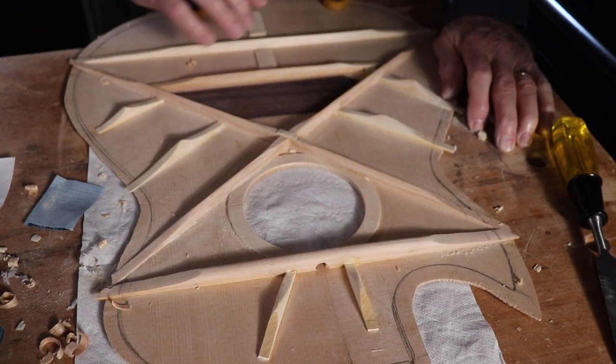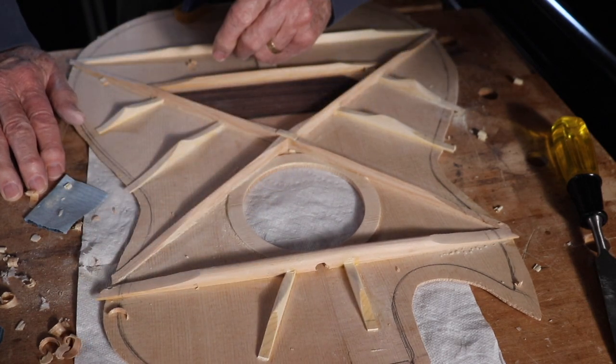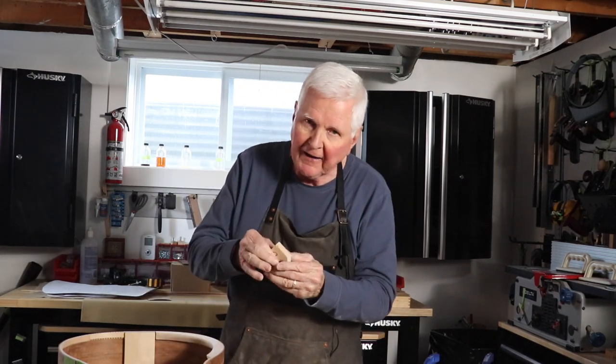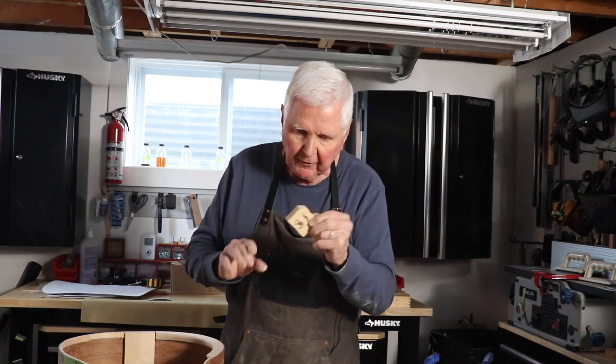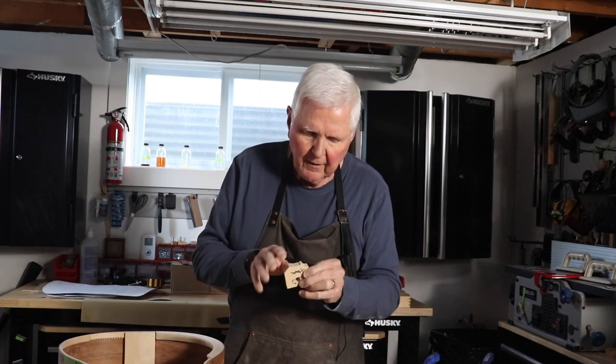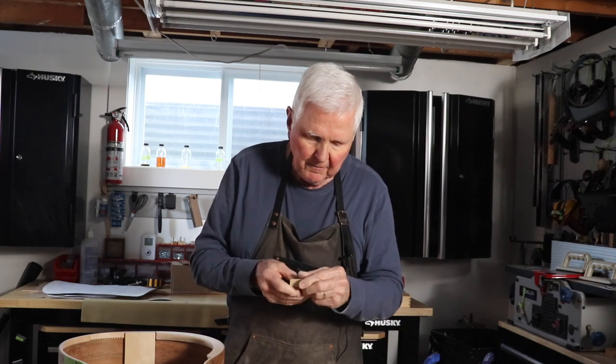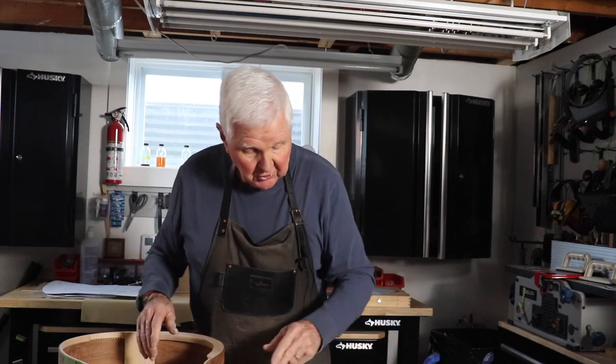I have to come all around the top and do the whole thing until I've got these all down where they need to be, and then I'm going to cut the sides of the guitar — I'll show you that in the next video. I think that's about it for today. I just needed to show you this because this is easy to make. It's a five-inch piece of Baltic birch — you can use hardwood, it doesn't matter. Whatever you have, get something like this, and when you're using your router, use a gauge, set it up for the depth you want, run it across, and then shape it. It's a no-brainer jig, and yet it'll save you a whole lot of time and will be very useful on your guitar.